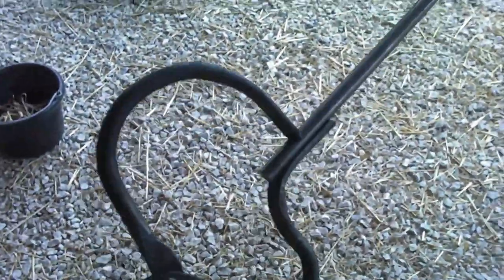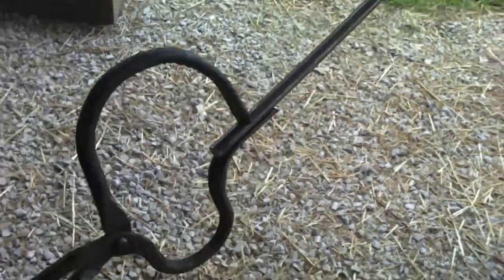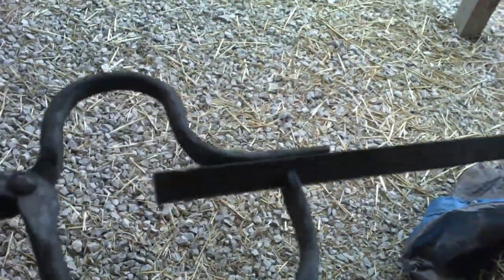This odd shape here — you put that on a piece of round stock and it does not move. You can hammer on it, beat on it, do whatever you want, shake it around, and it stays in there real good. It will also grab square stock just as well and holds it really good. So I saw those, saw how well they worked, and decided that was how my first set of tongs were going to look.